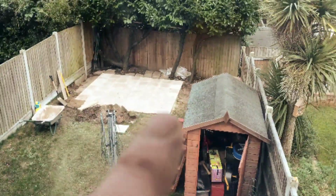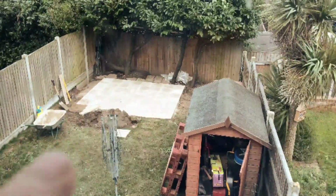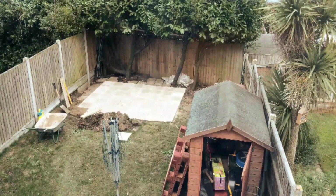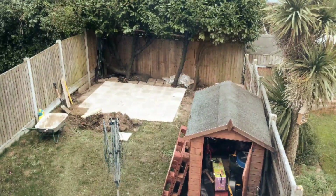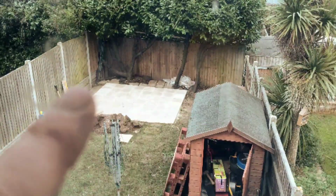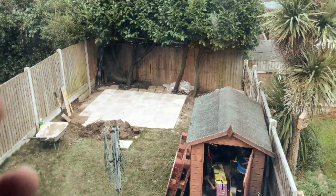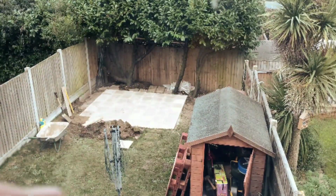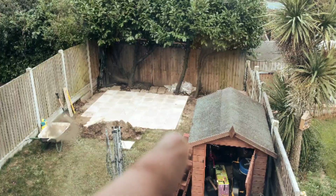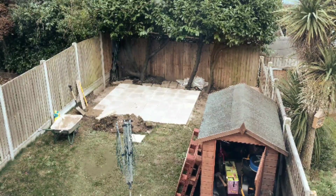It sort of tails off that way, drops off down that way, and has a slope down towards the edge. So I'm constantly checking level and long levels, diagonals, everything, and it's completely perfect front to back. And I deliberately had a very slight drop off that way, just because it needs something. I am 10 mil, if that, higher on that side than that side. So that's a centimetre, so it's not noticeable at all. It's perfect for what I need it for.